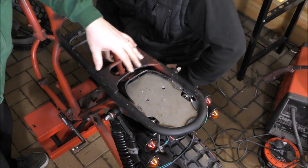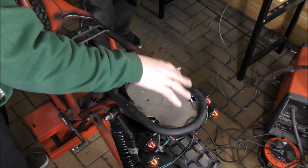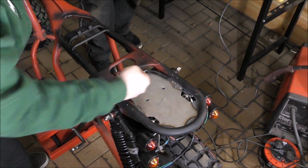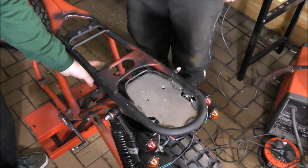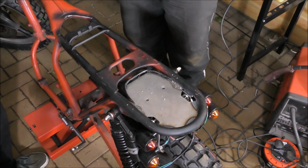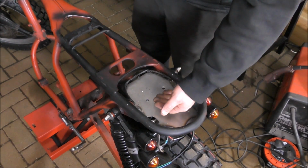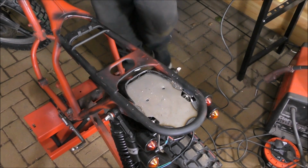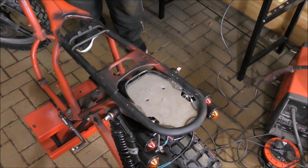But the reason for that is that, as Malcolm said, if we get splats through these holes here, and we get water laying in there, again it's going to be powder coated, so it's not going to get rusty. The water can then drip down there on the inside of the mudguard, not hitting any electrics down here, or any of the carbs, or anything like that. But also, when there's rain or whatever spraying up off the tyre, it might hit that metal tray, go to the back, and then it'll just flick off, hit the guard and go down the inside of the guard, not the inside of the bike. You said about water on top, I'm talking about water underneath. That too? Okay.